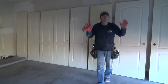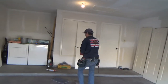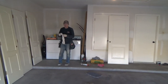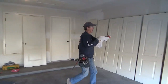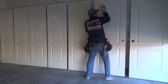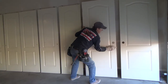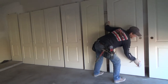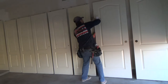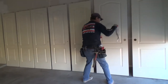Are we ready to paint? Not yet. Mommy's got to do one more thing — she's been taking a dry rag and wiping down the doors. Let me wipe down this one door that I sanded. You're going to take a dry rag because you've got sanding dust on here. So now you're going to wipe that — wiping the edge. If you don't do this, when you get ready to paint, your paint is sliding and going over dust. You don't want that.